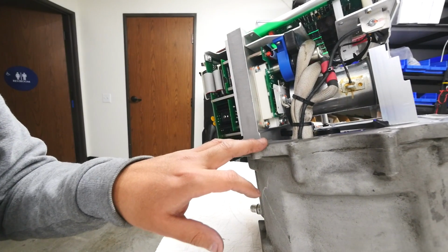At least with my motor, I know that it can operate up to 120 degrees Celsius, but I think the enamel on the windings has a rating of 200 degrees centigrade. So in theory, you can run it really high. The power electronics, they cut back at around 89 degrees, so they run at a lower temperature.